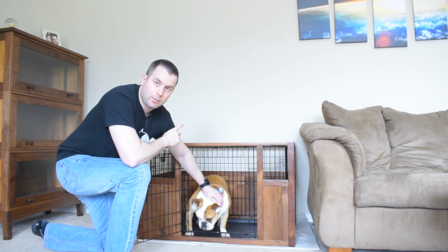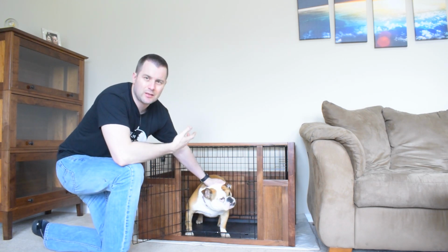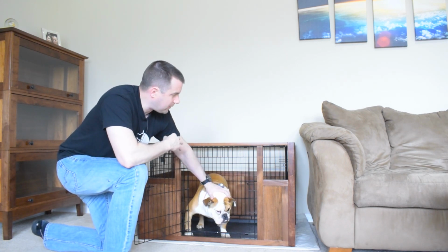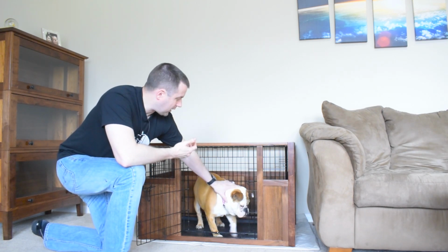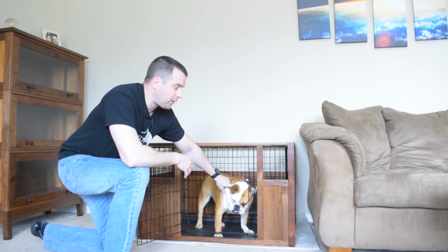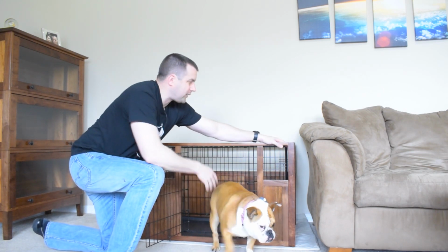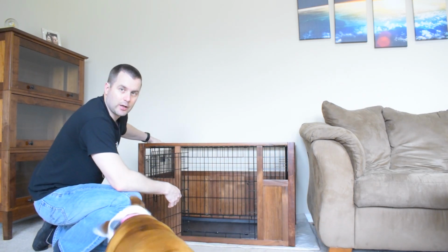So when I build the top, I'm not going to permanently attach it to the kennel cover. I want to be able to take this off easy, which means I want to keep the weight down, and so I'm going to do it in two pieces, and that's what you see here, the base of the cover and then the top. On the underside of the top, I'm going to have a couple of supports put in through sliding dovetails, but they will act to locate the top on the kennel cover, and that's on the outside here. But I just wanted to verify the spacing I had around the kennel on either side of the top here.